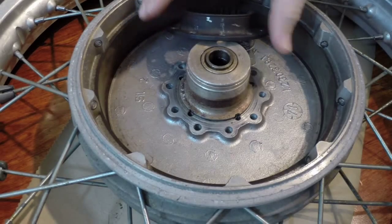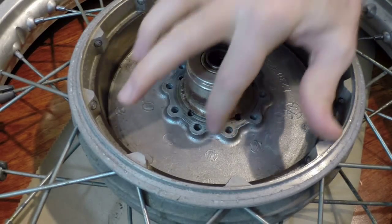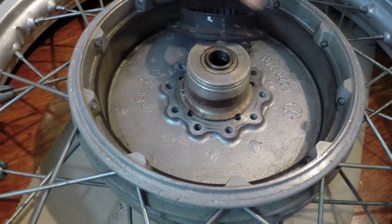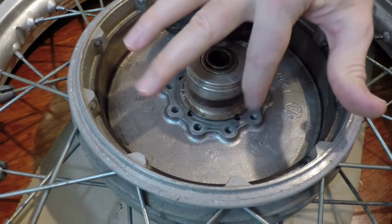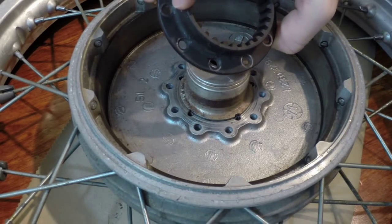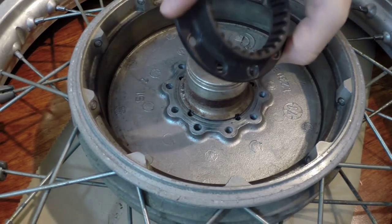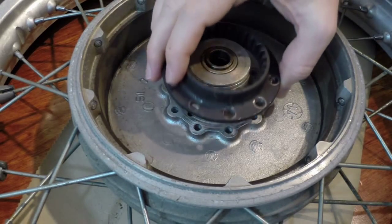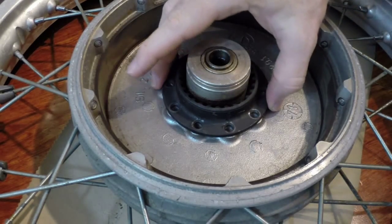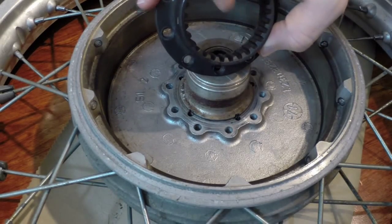I thought that's not a problem — I prefer the higher strength, larger diameter bolts anyway. So I just drilled out these aluminum holes from 5mm to quarter-inch using a quarter-inch cobalt drill bit. It's really easy to do and I recommend it. But the problem is drilling a hole in this driving dog. This is very high quality, very strong, hard steel. I'll tell you the truth: I could not drill through this with a cobalt drill bit — it's now completely dull and it didn't even phase the steel, which is actually a good thing. You want the driving dog to be as hard a steel as possible so these splines last as long as possible.